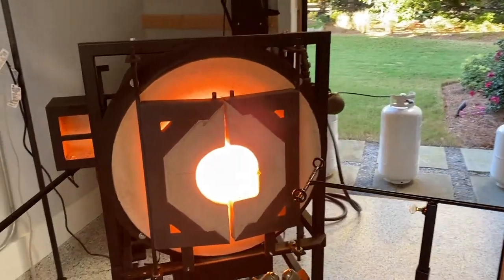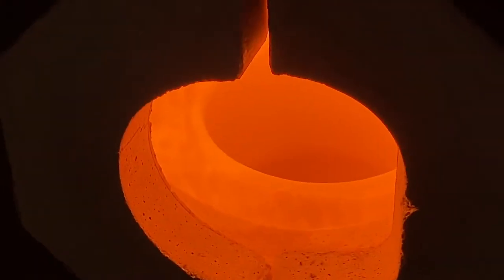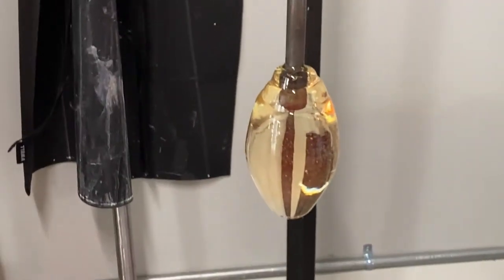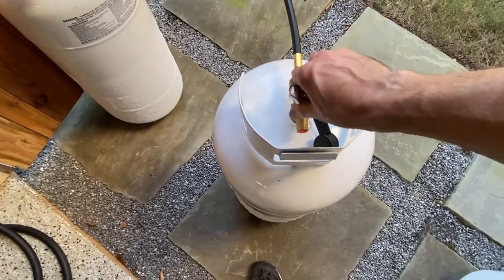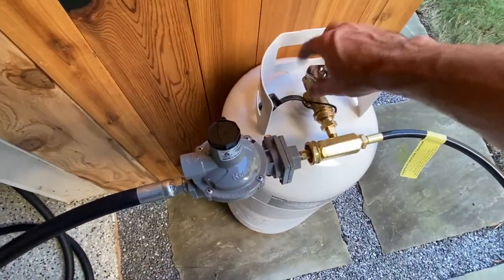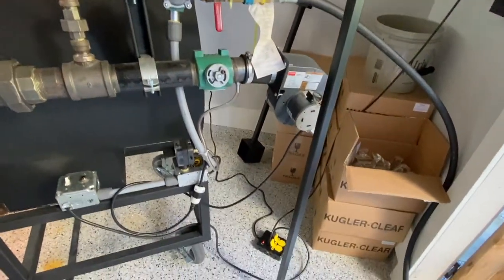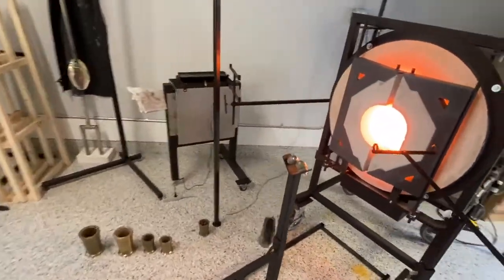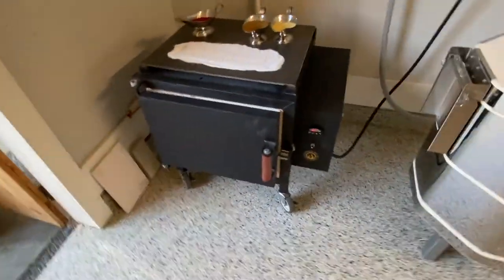I think that's it — it's a little bit after four. It's a little hot; maybe I need to learn how to turn that down. You can see the glass is almost empty — I'm just emptying it out right there. You don't want to leave a lot of clear glass in there. When you're done, turn it off — I turn the gas off first and let anything bleed out through the gas line, then turn the gas line off, but leave the blower on. And then I also leave the big blower of the hood on as well for about an hour, just to let things cool off without the heat traveling back up into the burner head.